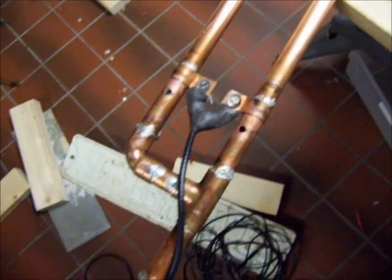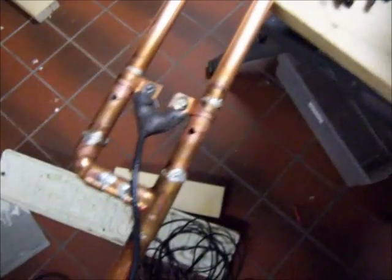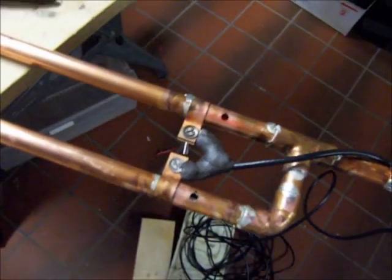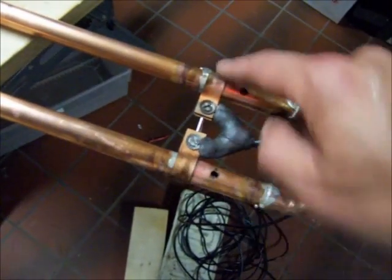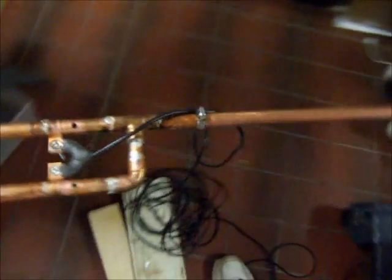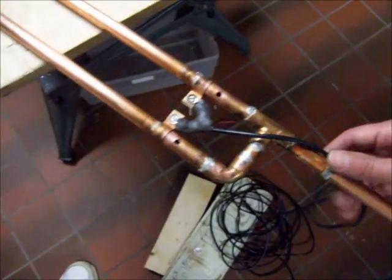That's all together. I used some PC Metal JB Weld-like compound from the hardware store to neaten that up and keep it on there, with a little hose clamp holding it down. These two were tuned until I got down to about 1.3 to 1.5, then I put a little flux and soldered them on so they're not going anywhere. The next step is getting it up on a pole outside. I've now got a longer run of RG-58U, which will take a little bit of the signal.